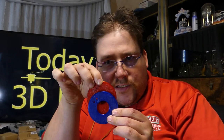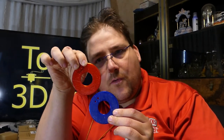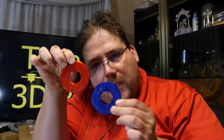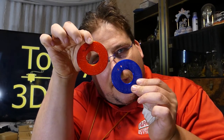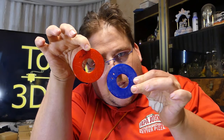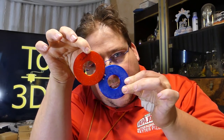And because of his layer height and how much he moved over, there was no longer this contact patch. It separated. So you ended up with the part here, and this part was able to curve up, and this part was able to curve out, because it wasn't attached to the previous layer, okay? So if you want to use a 0.25 on a thin vase like that, you're going to really want a 0.5 millimeter nozzle.